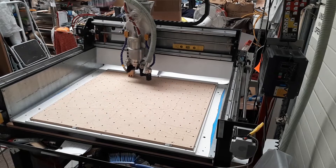So let's talk about the machine as it arrived and what we've done to it since. We've been cutting aluminium from the start, and very rapidly. We've been dry cutting 1050 aluminium which everyone tells you not to do, and we've had no bother. The knack with CNC is to buy the right bits — if you just buy any random bit off the internet, you're in for a sad result. You've got to research and buy quality bits, and that can make a world of difference.